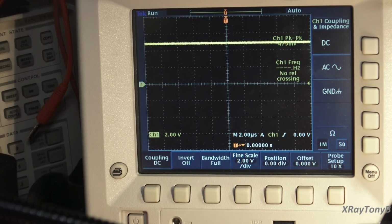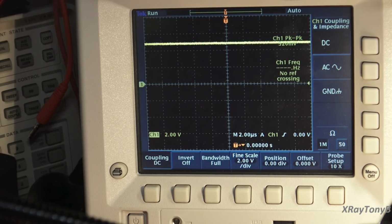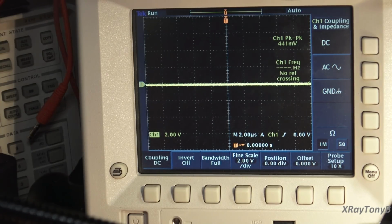And then if I keep tuning, you can see each time I cross over one of those lines. So my big fear was that possibly those little sensors, light sensors in there, would not react to the light from the LED. Because you never know if there was infrared or something that these little LEDs may not be on the same wavelength. But they're working fine.